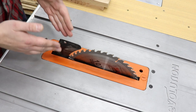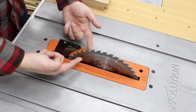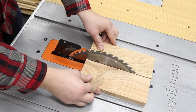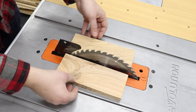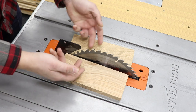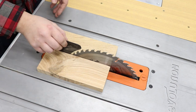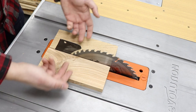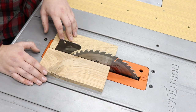One of the most important safety features on your table saw will be the riving knife — the piece of metal that's behind the blade itself. As you are pushing your material through the blade making the cut, the riving knife makes sure that the material you are cutting will not bind on the saw. If you don't have a riving knife, the two pieces may lock together on the back end of the blade, and that is super dangerous and will lead to kickback.